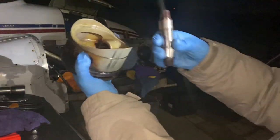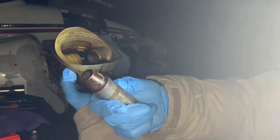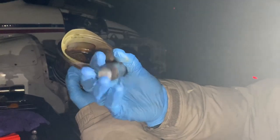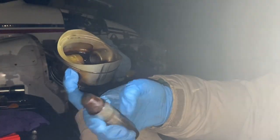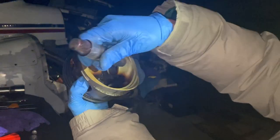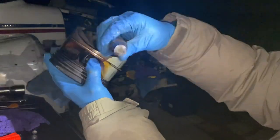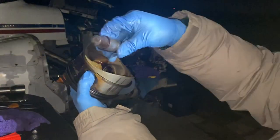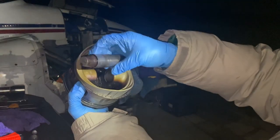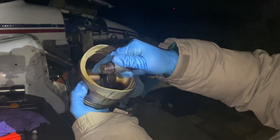So here's our wrist pin. The ends are just worn because this is steel and this is aluminum on both ends, the aluminum plugs. And so it rides back and forth. There's no cotter, there's no C-clips. There's no clips in here to hold this in. It just rides against the side of the cylinder wall, floats back and forth, between the piston and the connecting rod. You can see it's been going back and forth here in the piston.